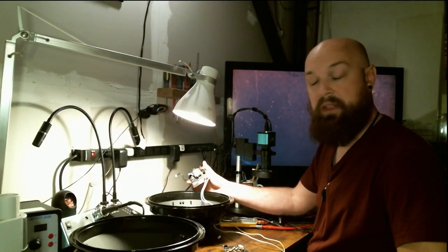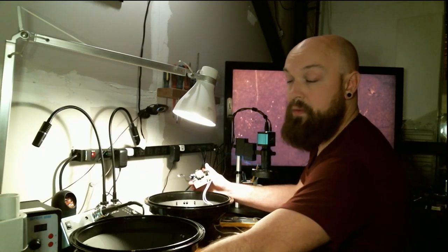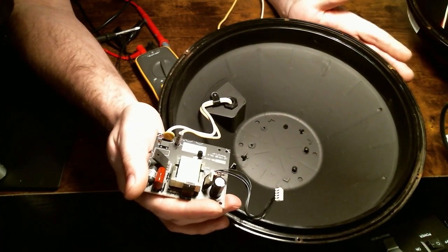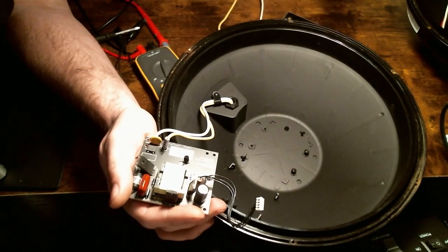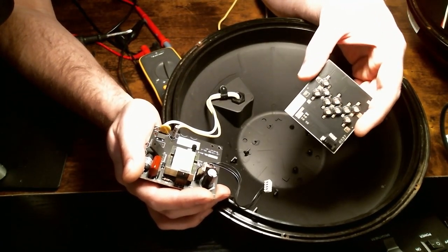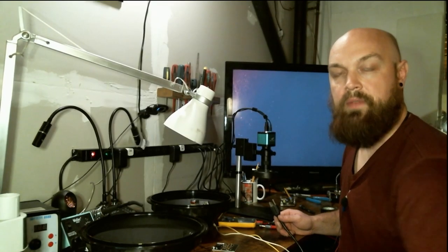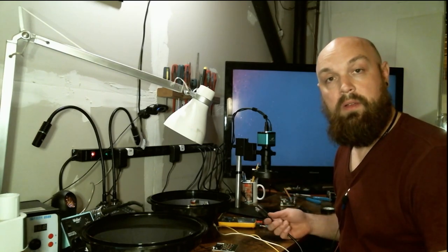As I was disassembling this power supply board, I noticed a loose connection right here on this board. Potentially when this light was being serviced, this was not plugged in all the way, and this supplies power to our LED board itself. So what I'll do is individually plug in this one light to see if this one light works. I've safely hooked this light up to a regular plug. We're going to plug it in, see if it works, and go from there.